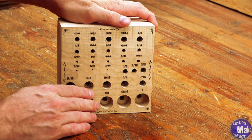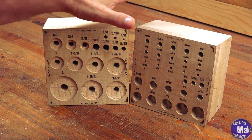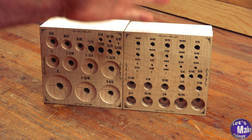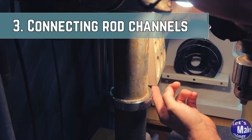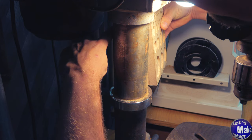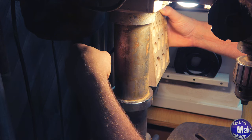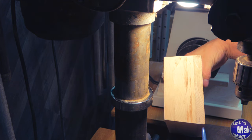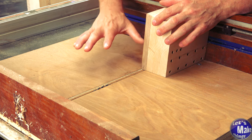When we bring it over here you can see it's a lot easier to see the bits — it's just at a slight angle, and I think that'll work really well. At this point, if you don't plan on adding this to the column of your drill press, you can stop right here. You can combine those two sheets to make one solid piece and just set it to the side. From this point on I'm going to show you how I'm going to add this to the column of my drill press. It's going to be a quarter inch rod — it'll go about like this and then back here on this upper corner. Once I get it to where I want it, I'll make an approximate spot, and these are my two spots right here. I'll move over just a little bit to cut that quarter inch slot out — it's just going to be a quarter inch box that we'll cut out on the table saw.